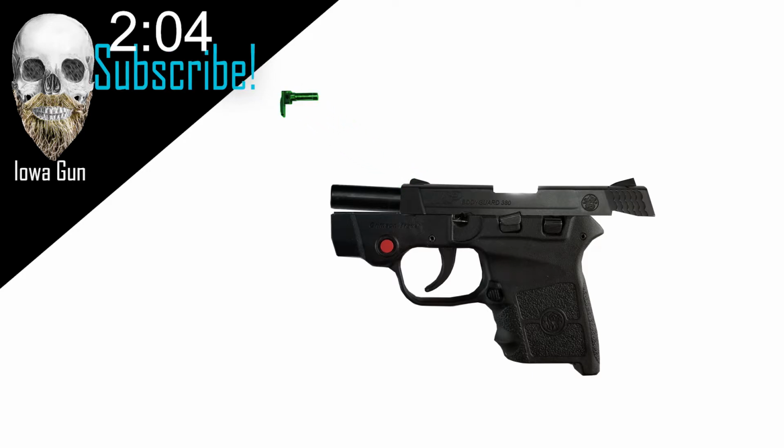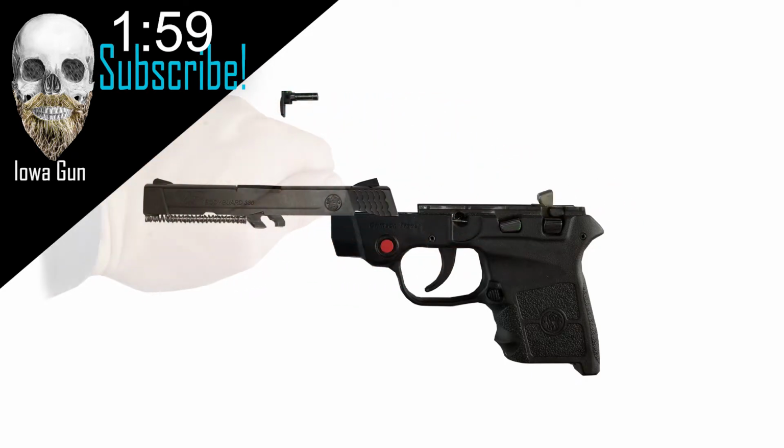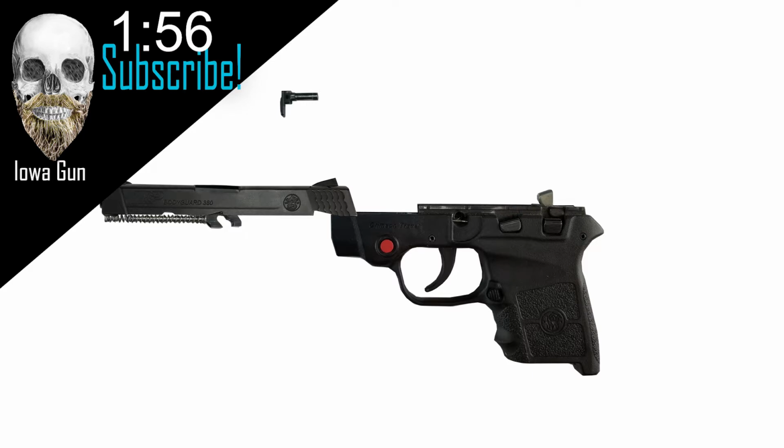Grab a hold of the slide and move the slide lock lever down. If you do not hold on to the slide when you do this, you are going to be crawling on the floor looking for parts. Move the slide forward and off the frame.